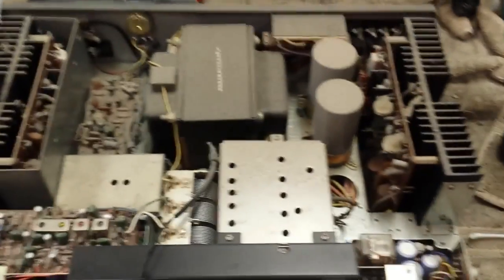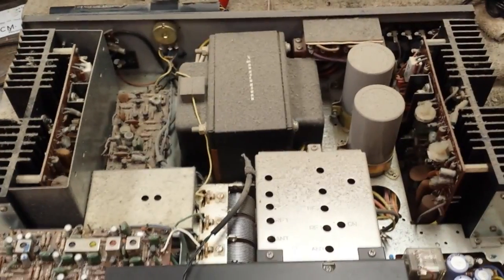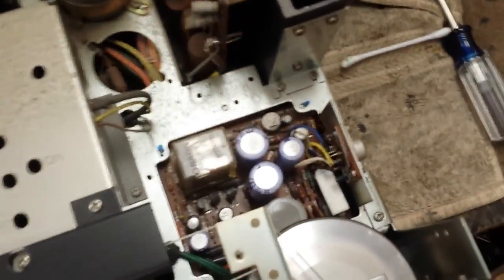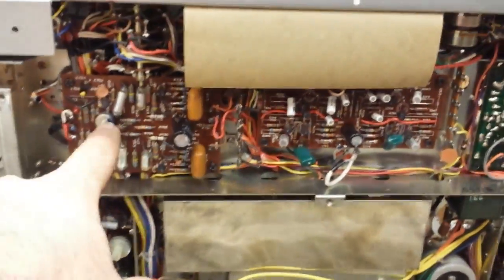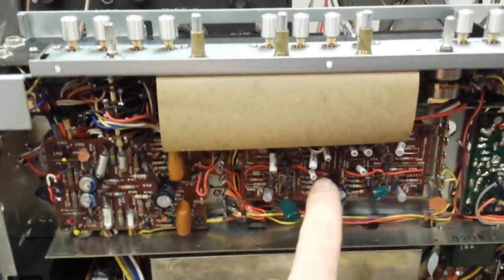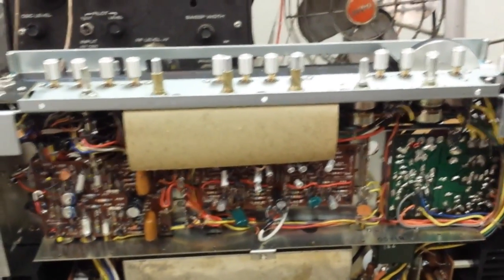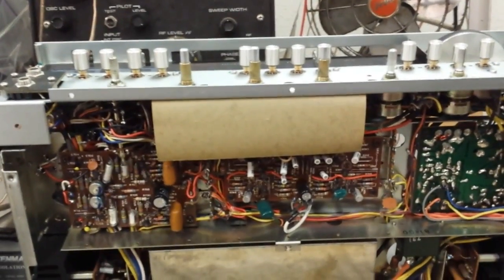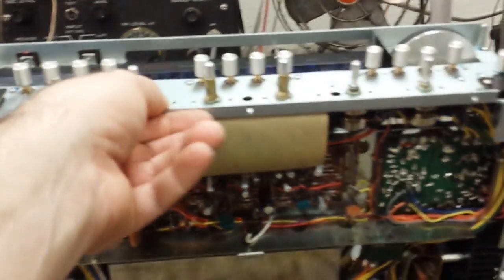This is looking into a 2270. The 2245 will look the same except for a smaller power transformer. The areas of concern are going to be your regulated power supply and protection circuitry, your switches and controls here along the front panel, lamps if you want to replace them. And underneath the machine is the phono preamp and the main preamp and tone controls. Depending on whether your machine exhibits symptoms of rumbling and hissing and crackling when you change the tone after cleaning the switches and controls, then you've got to look at leaky capacitors here, which is starting to be a very common thing on these machines.